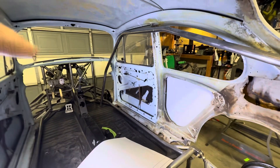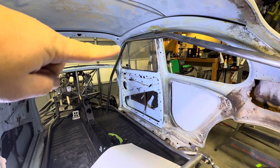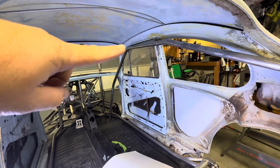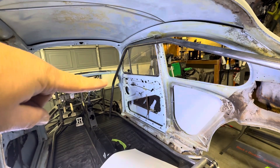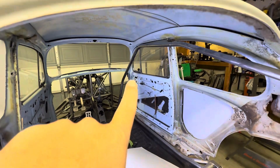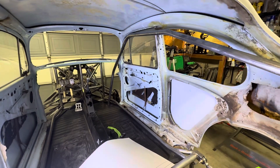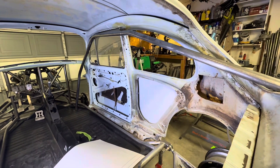These first bends came out really good. The only problem is this section of tube here is too long — that's just my inexperience not really knowing how I marked the bends. It ended up making this a little bit longer than I wanted. So I'm going to cut right here and add in a sleeve and drill some holes for some rosette welds. I'll land that section where I'm cutting it right on where another tube attaches, which should be plenty strong enough. I'll also add some reinforcing tubes — hopefully that works and I'll be able to save this tube.